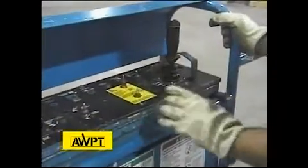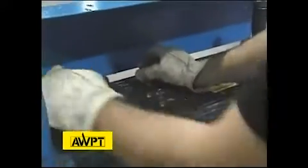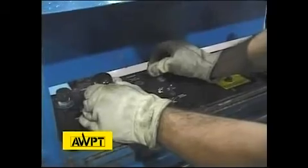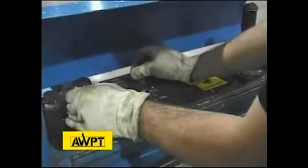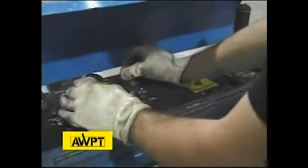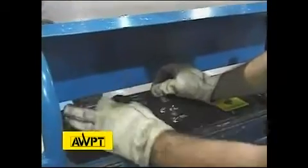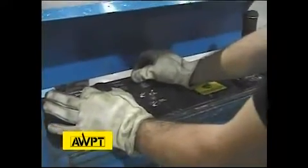Now that we turn our machine back on, know that it cut off, we're going to test our auxiliary power again through our entire range of functions. Basket level, basket rotate, boom extend, retract, boom swing the opposite direction, boom elevate, and boom lower.